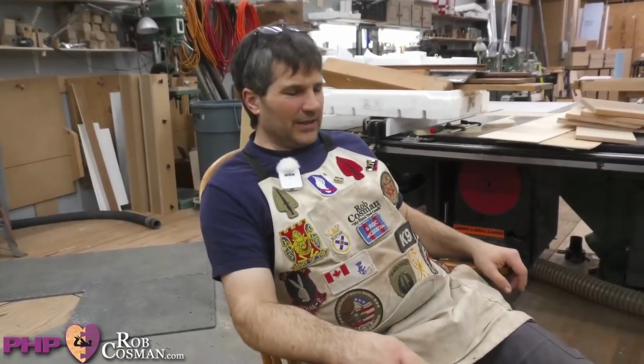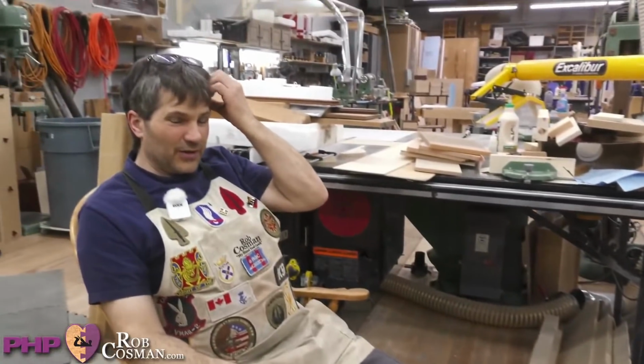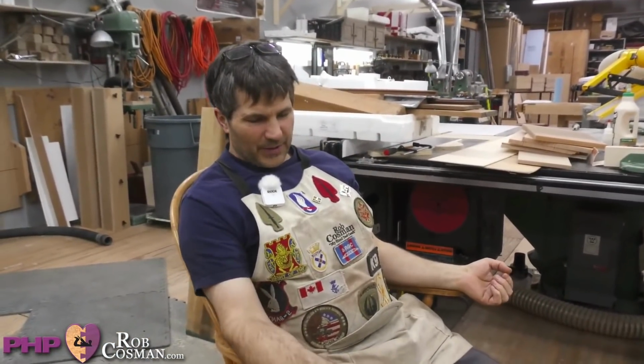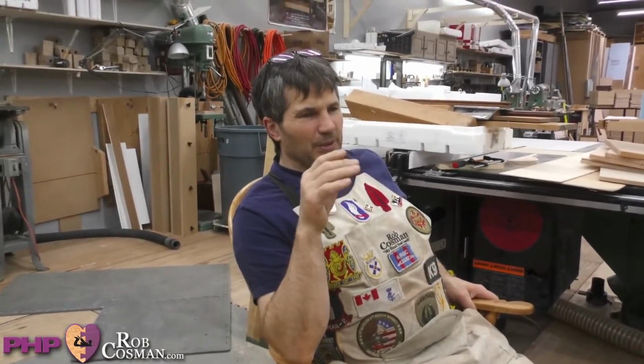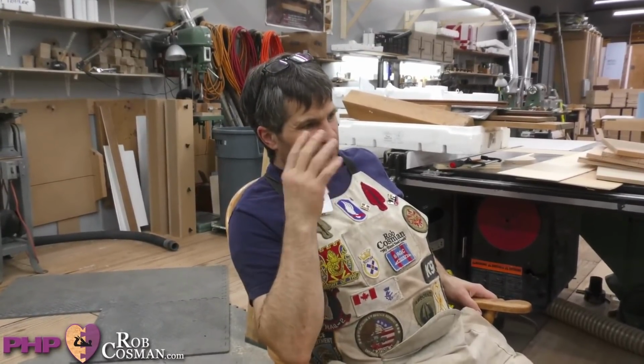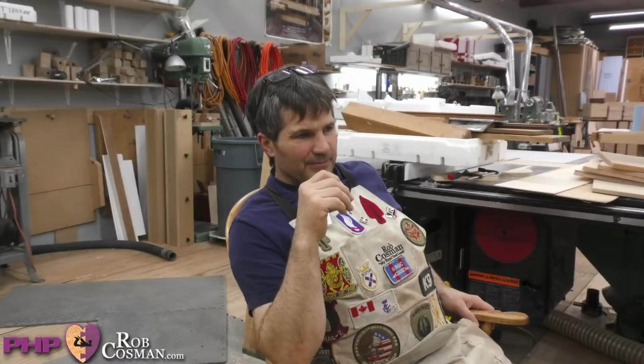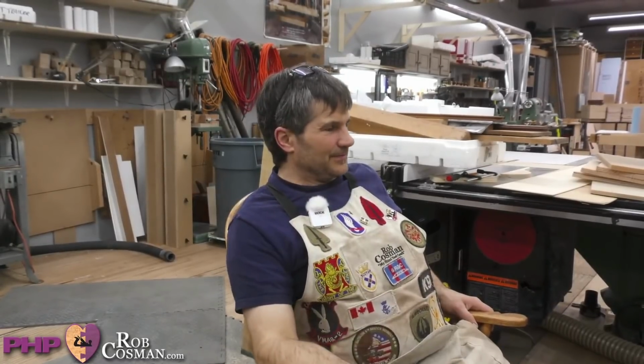The cedars would wear well outside, but they're not a very strong wood. So if you're doing an Adirondack chair where it's going to be relatively thick members, that's fine. But if you're doing any kind of a chair like this, where your pieces are going to be relatively small, then you've got to have a more substantial wood than cedar. You would never make a chair like that out of cedar. So number one would be teak, because it's probably the best wood for outdoor use. And then everything else is going to be a step down from that. So teak, Jatoba. I'm struggling to come up with any more. Start off with those.